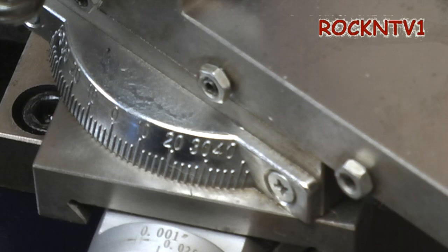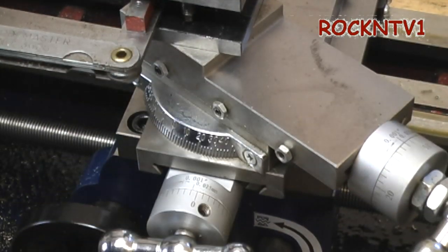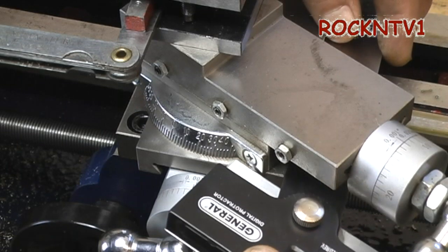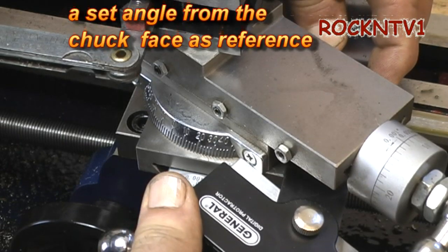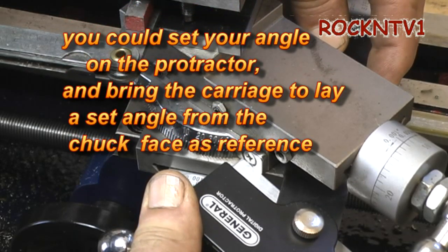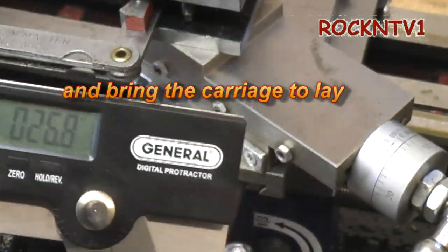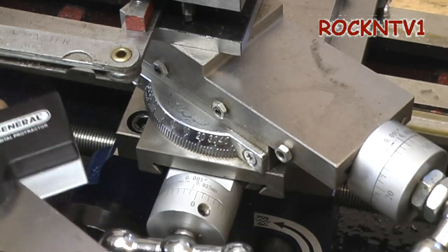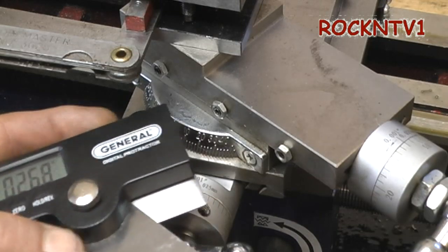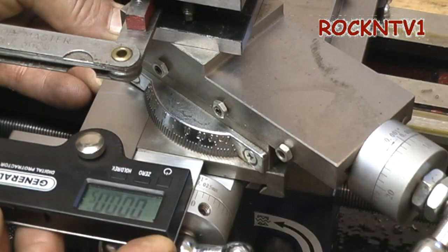When I get around to it I'll probably mark it myself — I haven't done any hole drilling on this machine yet, other than fixing a couple of things. So let me show you a couple of ways this can be checked. If I stick this on a 90-degree part and put this in here, my angle says about 27.25 degrees — now it says 26.8. So 26.8 to 27 degrees — the degrees on the dial are off by a full degree. How much that matters probably isn't much if you're using a fishtail to set up your threading gauge, which is probably what you should be using anyway to make your final adjustments. Here's 90 on the thing — hopefully you guys are seeing zeros there.